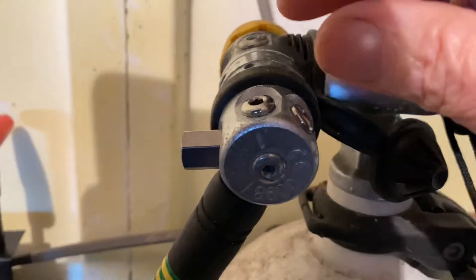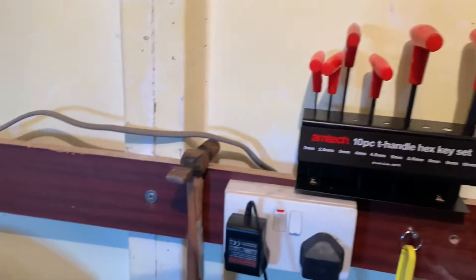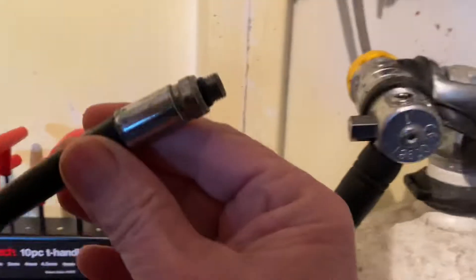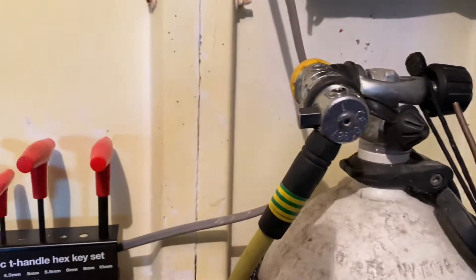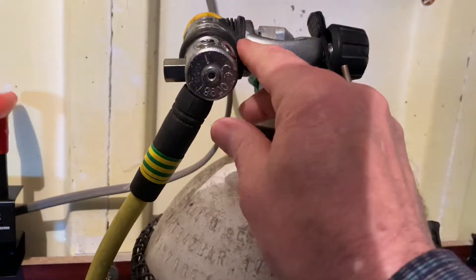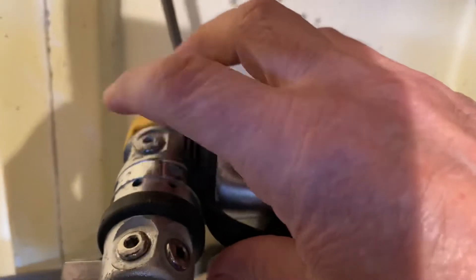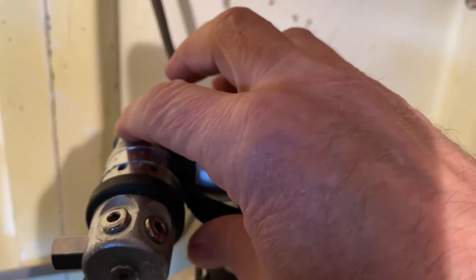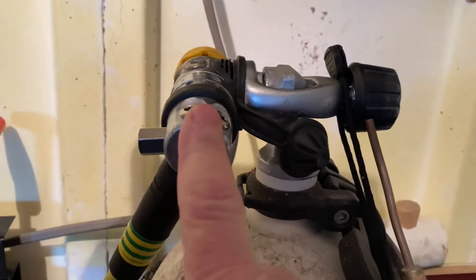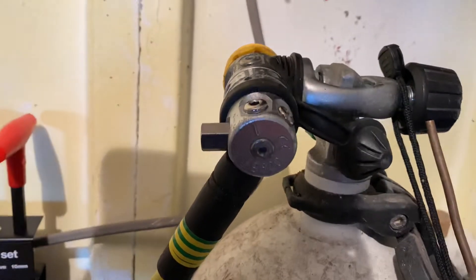What I've done — I've been down to the local dive shop and blanked off, took the pipes out, cut the existing pipes out. I did try to blank it and realised the error of my ways. Removed them all, kept one, and blanked off the rest. This return in the middle is not regulated — that is still 3,500 PSI. Only the ones through the regulator can you use. And you can test it with a gauge or test your regulators on it.